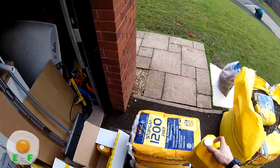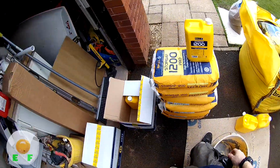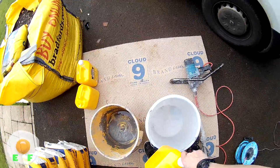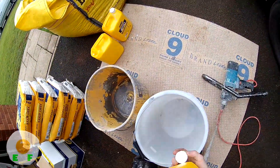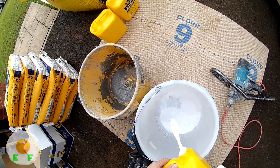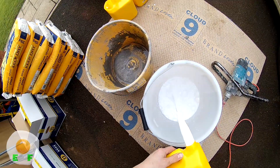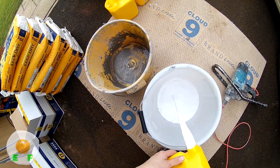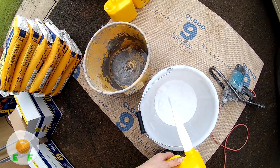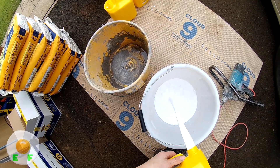Hi and welcome to another video by Eggie Fits. In this video I'll be showing you how to mix latex. This latex is Stop Gap 1200 Pro — it's a really good latex we use for most things. It's very good for going over adhesive residues, so leftover adhesive from floors that have been previously laid. If you rip up your old floor there'll be old glue down, and this latex will solve that problem.